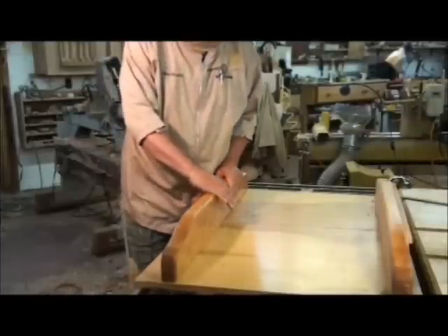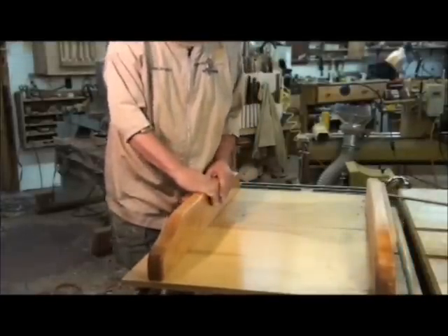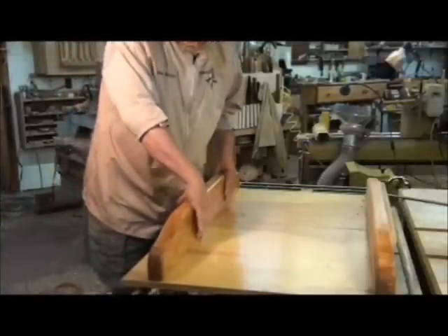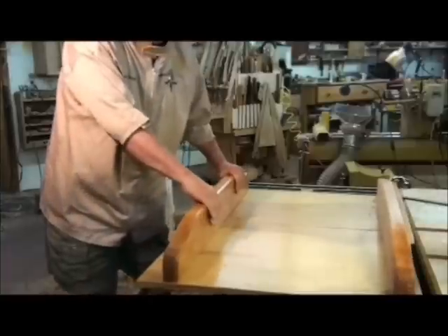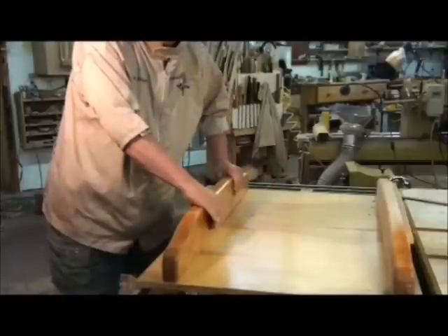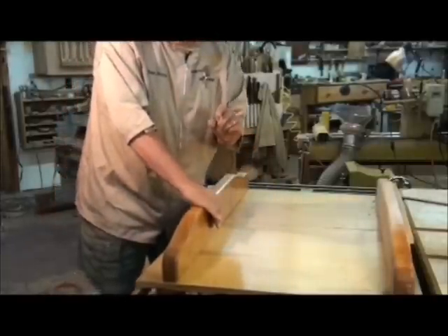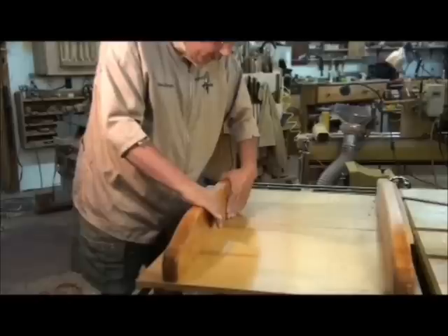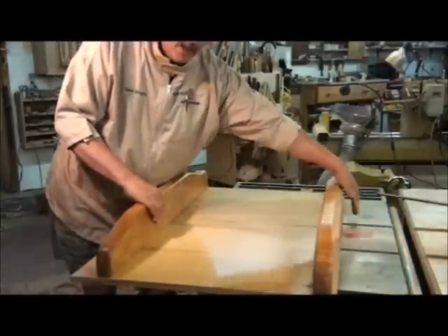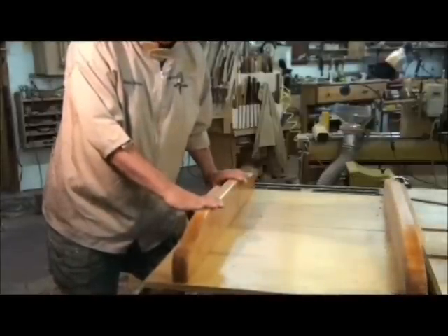This is no doubt the best safety feature you can add to your table saw — a very large sled. I can clamp different pieces onto the back of this sled, keep my fingers away from the blade, and I find myself using it for very small pieces of wood. It's very accurate, runs in the slots of your table saw, and is a great safety addition to your shop.